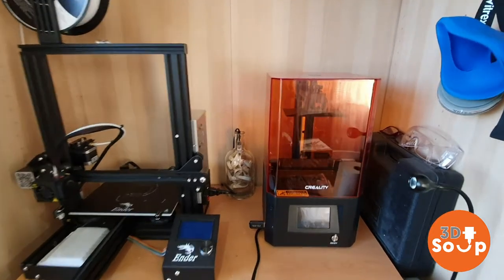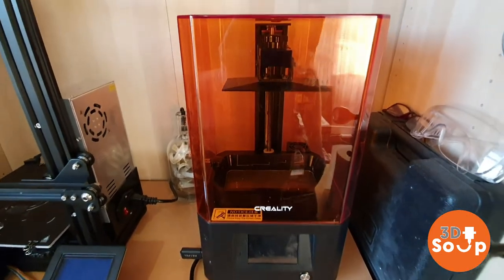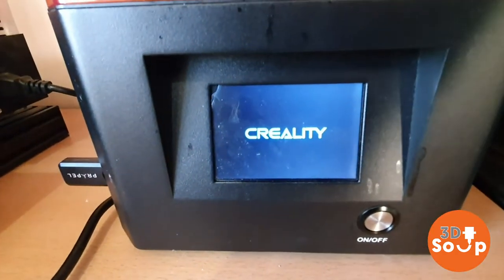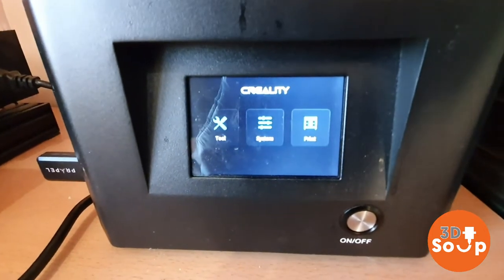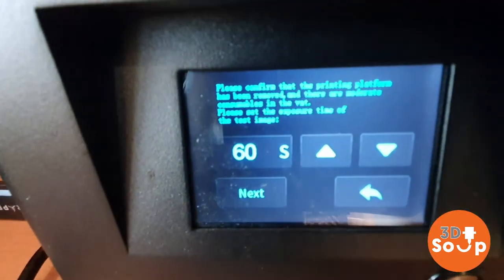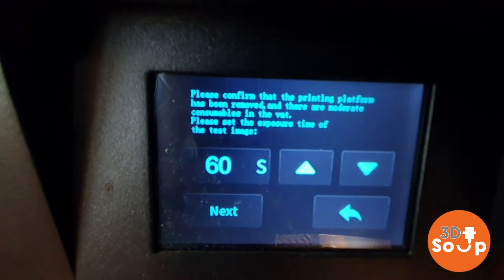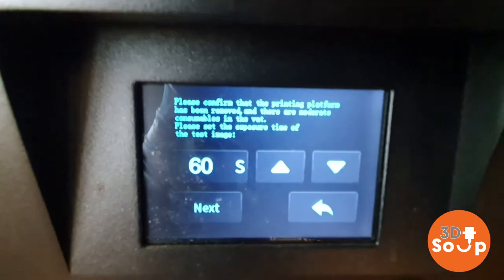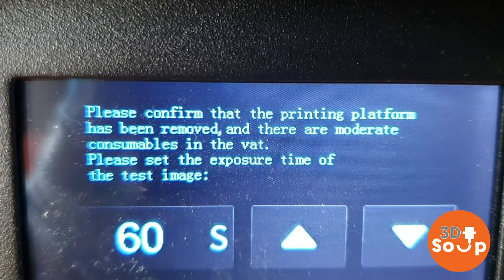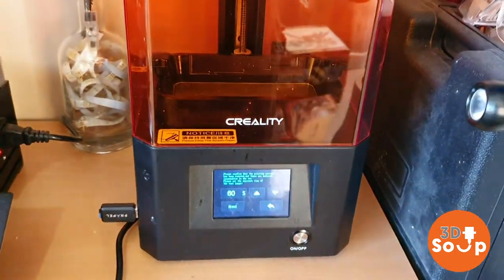It's been about two years since I bought my Creality resin printer and all in all I'm very happy with it. Now because it's got to a certain age we have to replace the film. When you use a resin printer, the resin adheres to a very thin film of polythene and it's torn off every time a layer is cured. After 20 or 30,000 times of that being done, the resin does tend to wear through the film. So we're going to use the maintenance settings on the resin printer to shine UV light through the remaining resin attached to the polythene and make it go crispy.